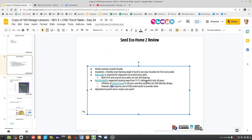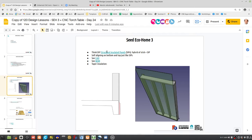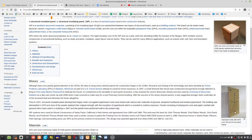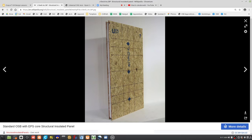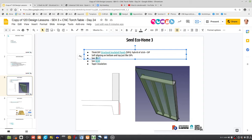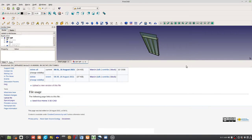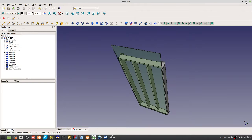We have to put the OSB on first and then put on the final sheeting at the end. That breaks the modularity somewhat — it means you do a rapid wall install, then add the final paneling. First floor, no problem; second floor, you're at height. Also, what about adjustment panels? If your walls lined up to not exactly fit the 32-by-16-foot footprint, the wall doesn't fit and we have to cut down panels — a major pain point we're going to avoid.